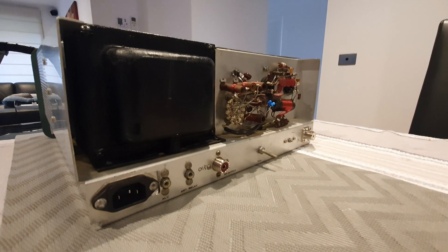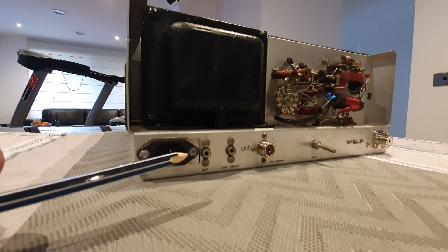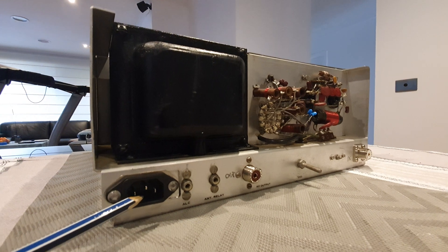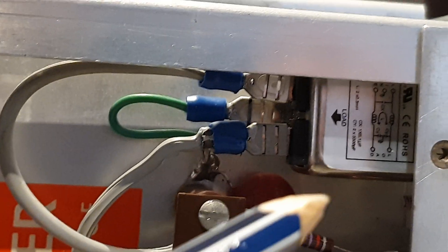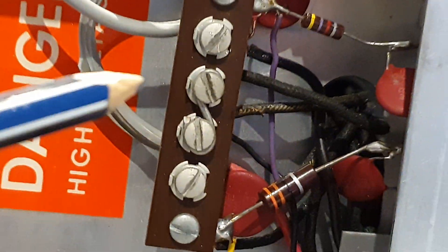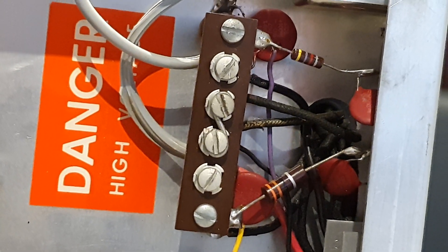On the rear side of the amplifier — because Australia is 240 volt — I replaced the small fitting with an IEC fitting, and this is a filtered fitting as we can see here. It fits in there quite nicely and I've just run spade connectors off with the original power back into the Q3 power distribution block for the transformer.